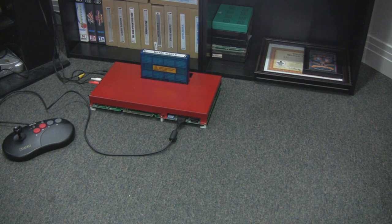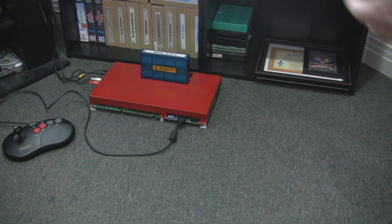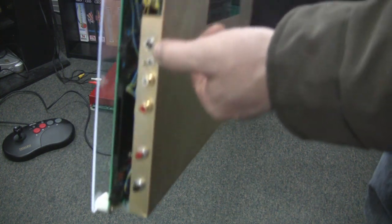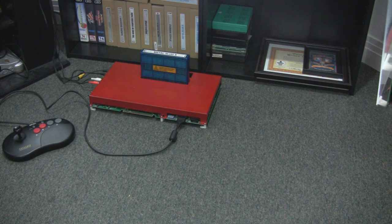It's actually really good bang for the buck. The other thing is these boards run off 12 and 5 volts. I've converted it so that it runs only on 5 volts, so we can use a standard AC adapter instead of an arcade power supply. This will run off 5 volt, 3 amp. I found an AC power supply for 99 cents at a thrift store — it was 5 volt, 2.8 amps — close enough.